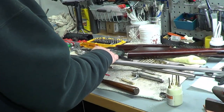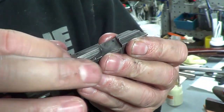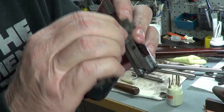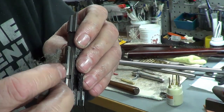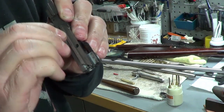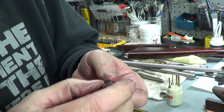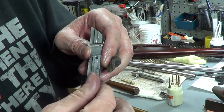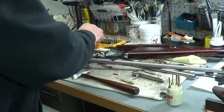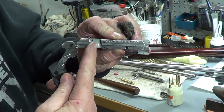Let me get my bolt out of here. So this bolt, these rails — I'm going to put some sandpaper on these. I use like 1,000 grit or 2,000 grit sandpaper, maybe even a little steel wool. I can probably smooth these down with a little steel wool and you'll see it polish up. I can feel already that I smoothed it. This side is already smoother than this side. These locking lugs, these two things right here, lock into here, so I'm going to make sure that's nice and smooth with no sharp edges.